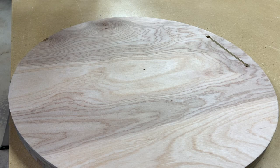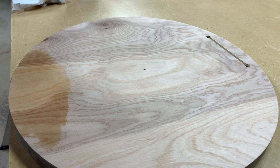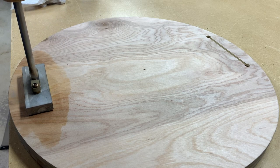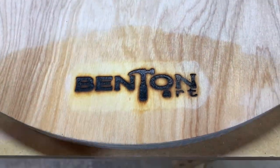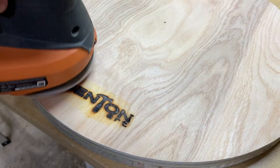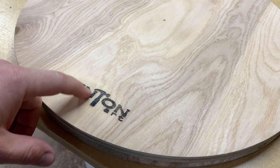I got my branding iron really hot, and I've seen that if you spray water on the surface before branding it prevents some of the burnout on the edges. So we're going to test that out today. You can see I burned in the name of my woodworking business, Benton Art. I'll take a sander and it'll clean up. It did prevent a lot of the burning around the edges, so I'll give it a quick sand after it completely dries and it'll reveal just the logo nice and clean. That wetting technique works really well — typically I'd have to sand a lot more down. I have a nice indentation still from my logo.